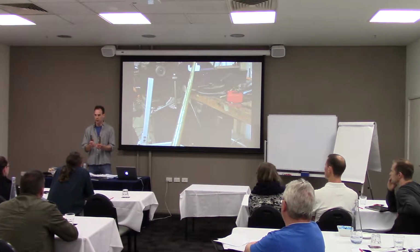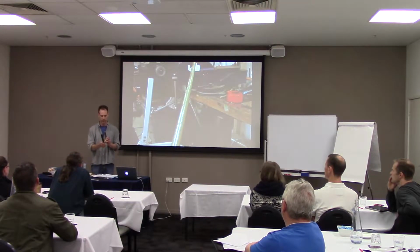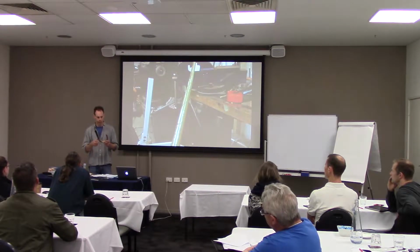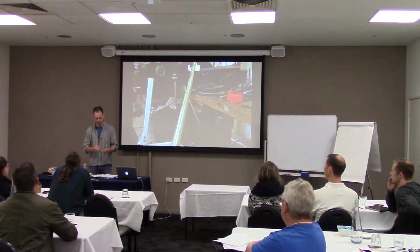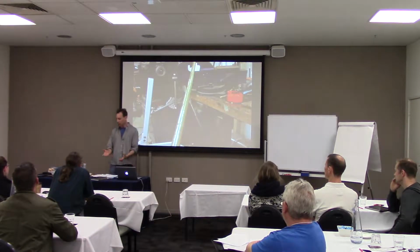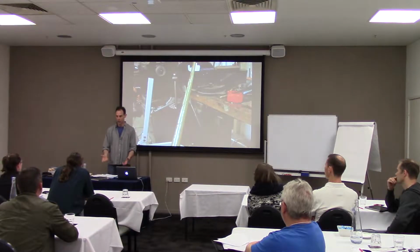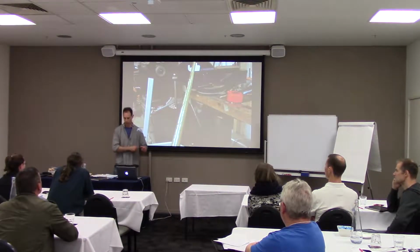Now when you are bending these, make sure that your seam is off at like a 45-degree angle. I don't like to bend on it. I think this is an example here of a failure. You can see it just took too much pressure, plus it was crappy pitch. And then it depends on temperature. Lawson always said cold and quick. If you're going to use the pitch, he used to keep them in ice buckets and then pull them straight out and bend them that way.